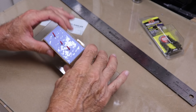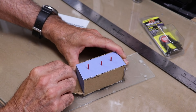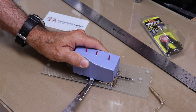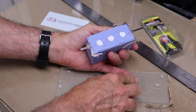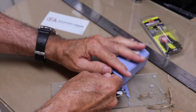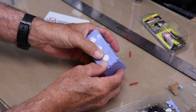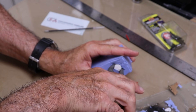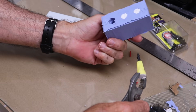It's really just a simple matter of dismantling this thing pretty much the way we put it together. Typically the silicone won't stick to just about anything — when you see it sticking to glass it's because it's getting old. We get our little pen insert out without destroying anything by just pulling it out, then pull out the little vents. Now we just need to get the masters out — it should be just a matter of twisting them since they have a thread. Some pliers do the trick — just turn it and it unscrews itself from in there.